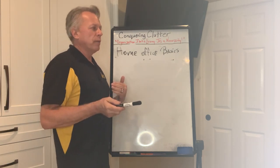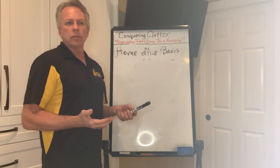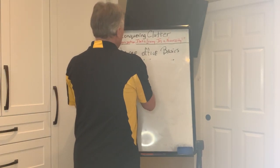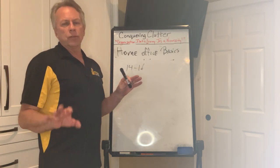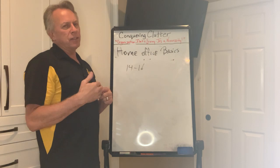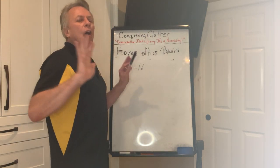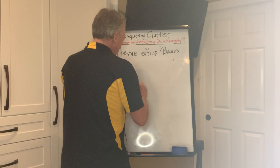Throughout the room, it's up to you what storage you want in your home office. Some people like a wardrobe system on another wall to store clothes or office items needed for their job. For any storage cabinetry on other walls, try to go 14 to 16 inches in depth. Unless you're storing long files, you don't want to make those cabinets too deep — with small items, it's hard to get to things in the back. 14 to 16 inches keeps everything closer and visible, unlike a 24-inch deep cabinet where you're wondering what's back there.